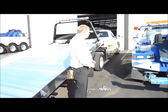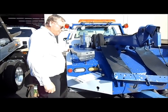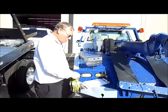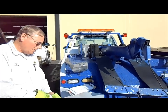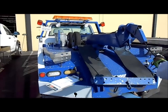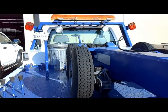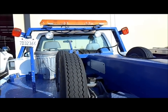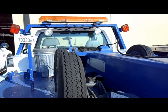We're going to show you two on this older truck here about the cable. If it doesn't have a cable tensioner on it, I'm going to pull this cable off and you can see how it messes up here on the winch itself. See how the cable just unspools and just goes nuts without a cable tensioner. So it's very important to have a cable tensioner on it — it saves the life of your cable.